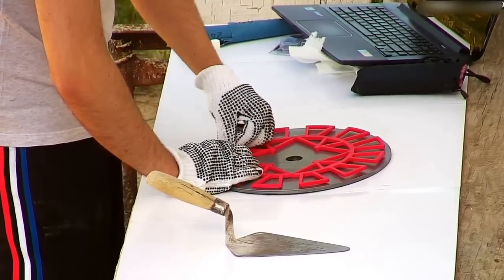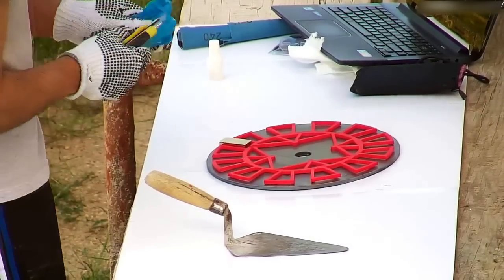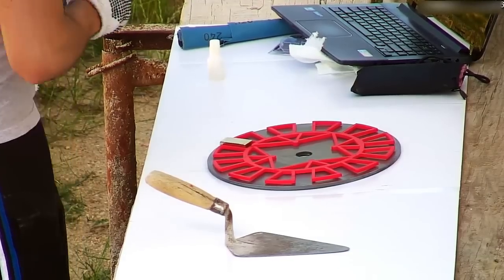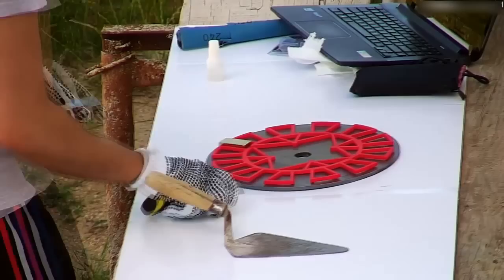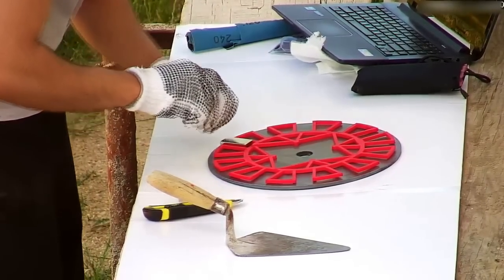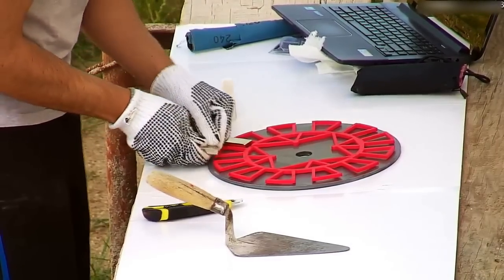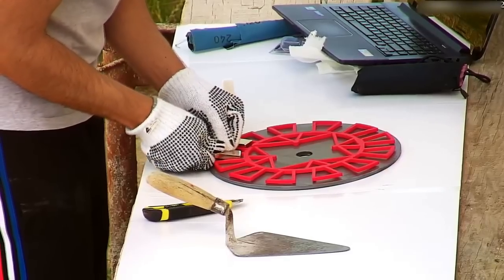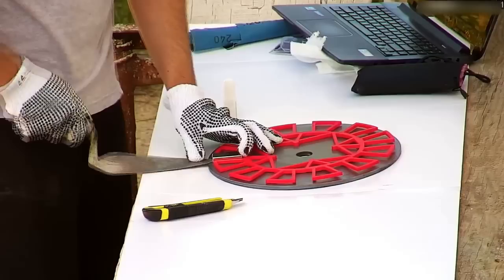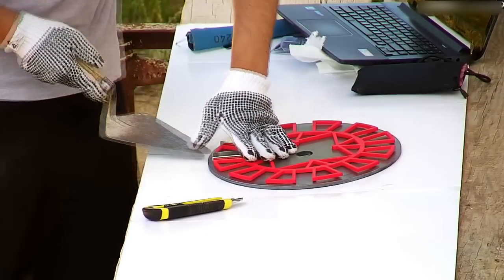As you know, the magnets have two polarities. The way you have to glue them to the disc is: if the last magnet has the north side facing up, you have to glue the next magnet with the south side facing up, or vice versa. I am testing here — the face that repels the last magnet is the one that is going to stick to the disc. You should always test if all the magnets are in the correct position, as you can always knock them off. As you can see I am using a trowel to get one off because it wasn't quite in the right position.